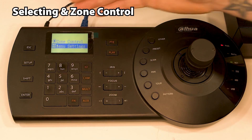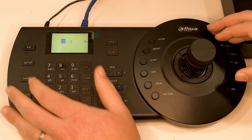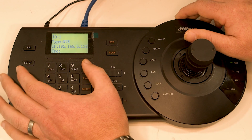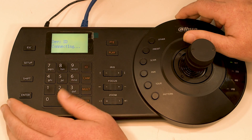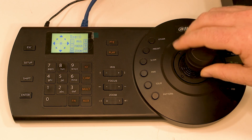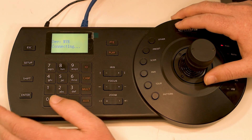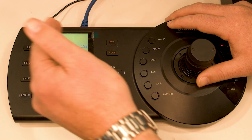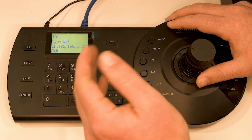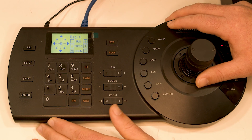So all that we want to do now is zone control. From this menu, you can now select the zone control, you go in, you select your ID which is one — it's a recorder — and that will now connect to the recorder. Or if you want to, we can use zone two, and that will now connect to the PTZ directly. And it will show you as you pan tilt zoom. Once you are done, we can just go back to ID one and enter, and that will then connect to the recorder again. If you just want to view a singular camera, you select the camera, you go cam, and that will open up just that camera. If it's a PTZ, like the particular channel that we've just chosen, you go for PTZ, and that will open up the PTZ menu. If you want to change your multi view, you select a number. So if we want to go into a four split, we're going to go four, multi, and that will change it into those zones. Or you can go eight multi, and that will take it into an eight multi for you.